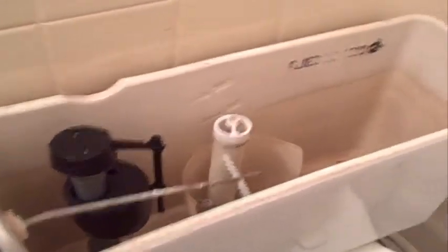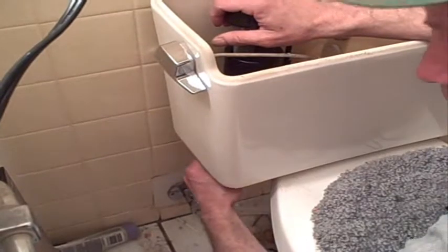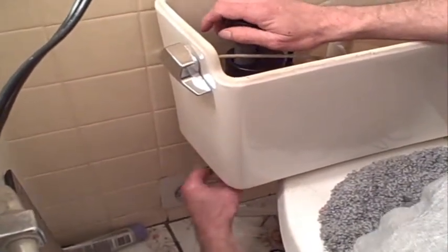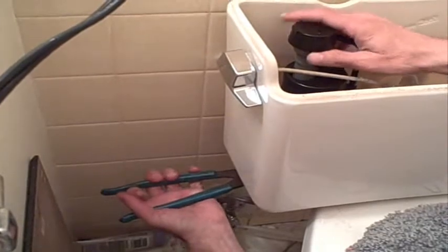There's a smooth side and a rough side — see how it's got the little ridges there? That's the side that's going up, that's what you're going to screw up with. Just get it on there, back on the threaded part, screw it up. You're doing this in reverse order from how you took it off. I've got that good and hand tight. Now snug it with the channel locks. When you're using channel locks, don't put a death grip on it and don't over-tighten it, because you can break it. Just enough — get it on there real snug.